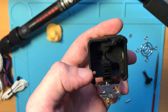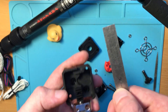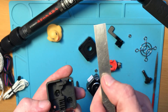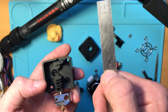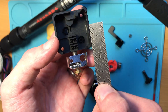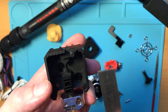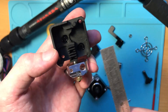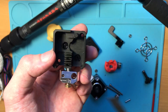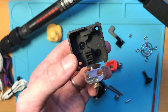To give an order of magnitude: the Mosquito Magnum I currently have on my RailCore has about 55 millimeters of filament path. The Mosquito by itself is a little less, but you always need to stack up some material to get from the top of the hotend all the way to the extruder wheel. So at 40 millimeters, the H2 is already a pretty nice starting point on paper.